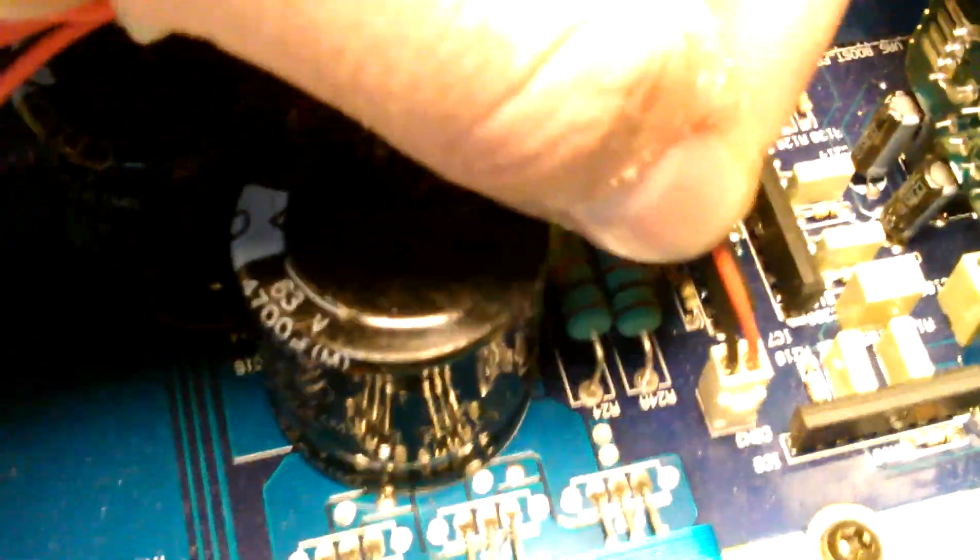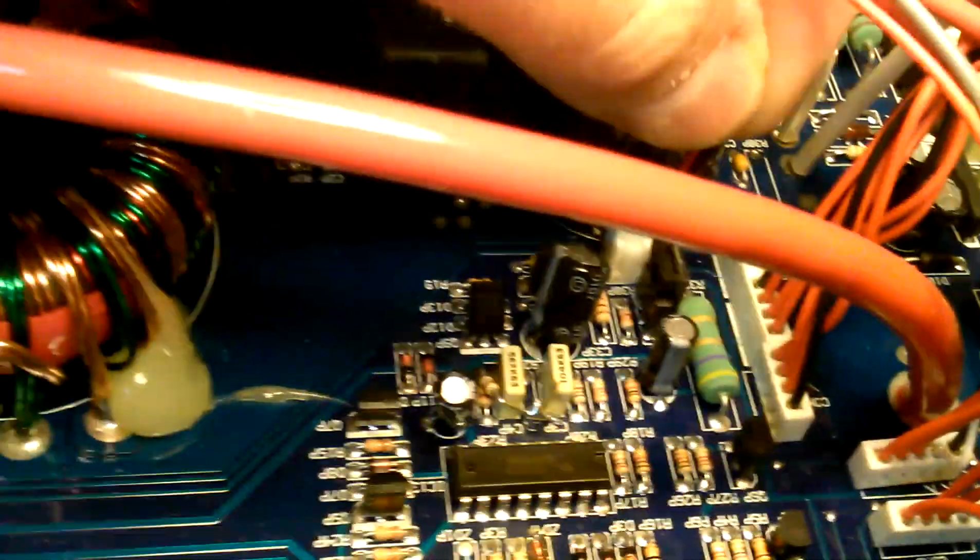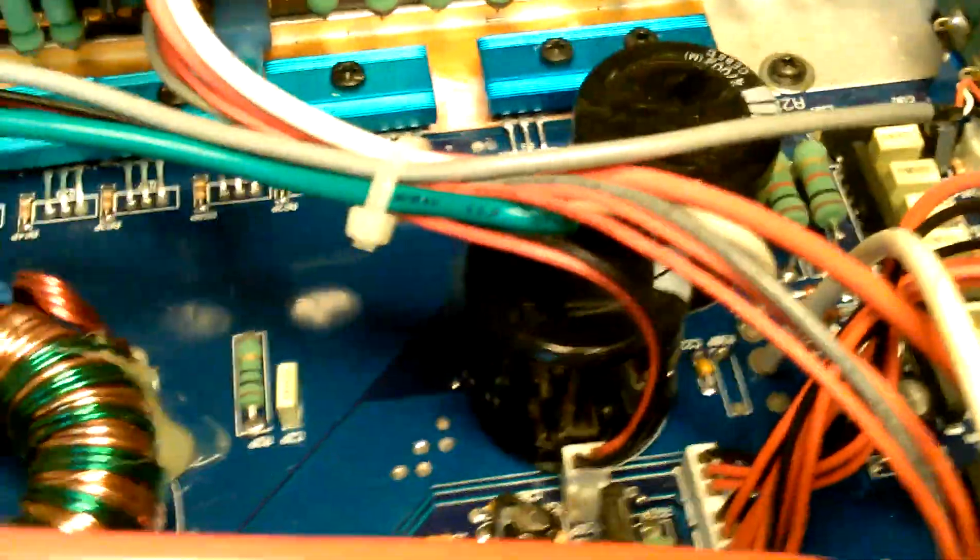You also get bad connections with plugs being smashed underneath the circuit boards for the meters — a lot of tension on them. All these plugs are weak points. See this — I can just shake this thing around and it's loose, straight from the factory. Not good. Every plug I run across like this is a problem, except for a few fixed ones down here that are a little more snug. Just wanted to show you some extreme weak points on these amplifiers.